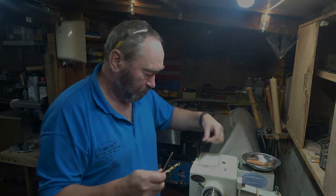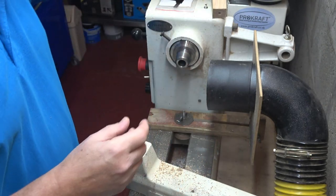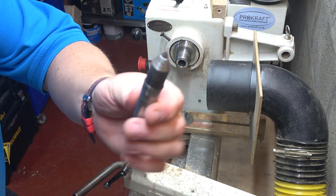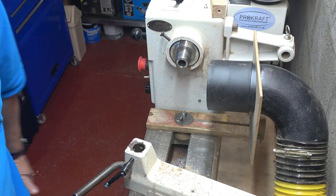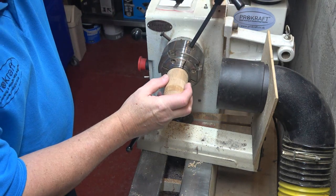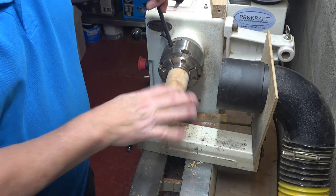Let's do the drilling and then we'll mount between centers. I'll show you a little trick with mounting between centers if you don't have a dead center. I now have my piece of wood with a nine millimeter hole this end and a five millimeter hole this end. Normally what I would use is a dead center — we do sell them, they're not particularly expensive — but if you don't have one, don't panic because you can make your own. I have a chuck, I have a scrap of wood. Insert the scrap of wood into the chuck and I will turn it to a point. If you don't have a chuck, you're stuffed.